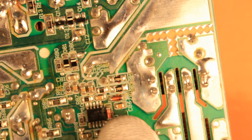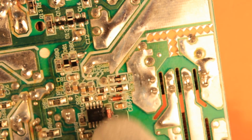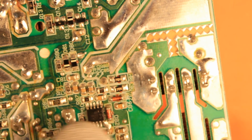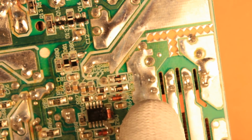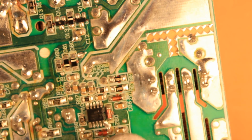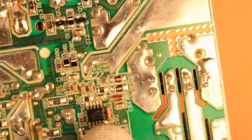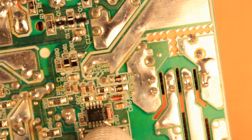And then you might see here on the chip as an example, this leg here has a lot more exposed area, and that is because the board then travels in this direction through the solder wave. So they don't want the solder to get stuck on the two legs and short-circuit those two legs. So this is why they use a larger exposed area.